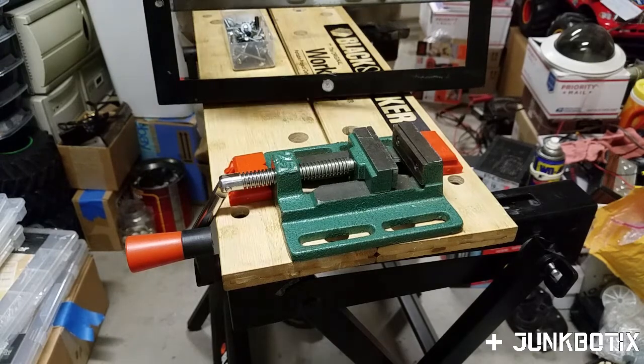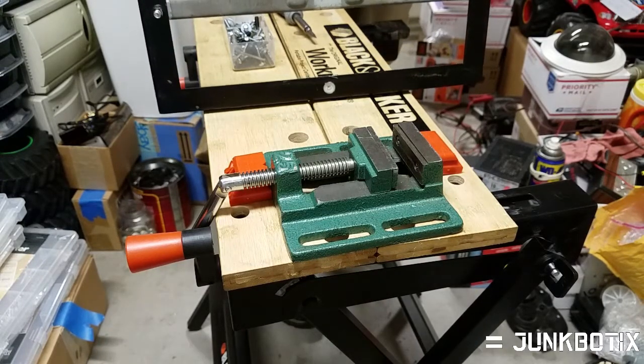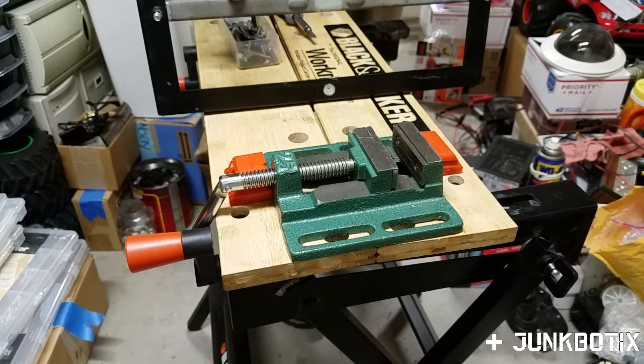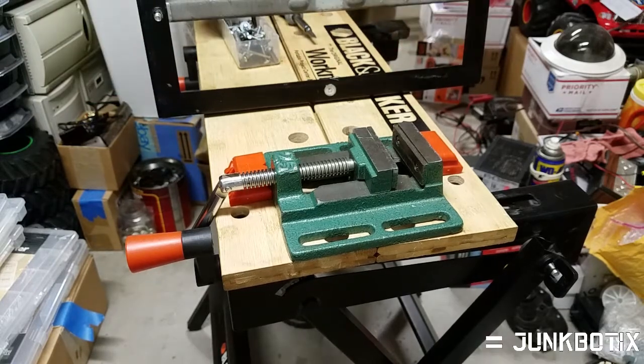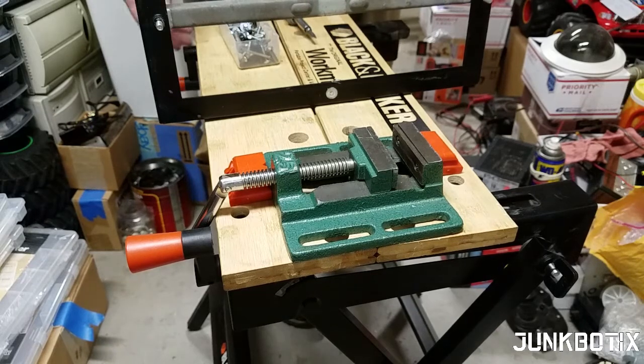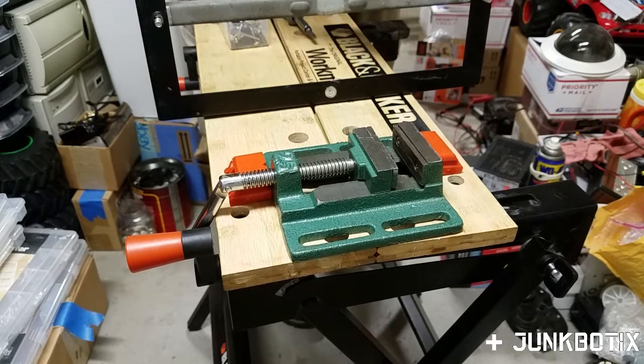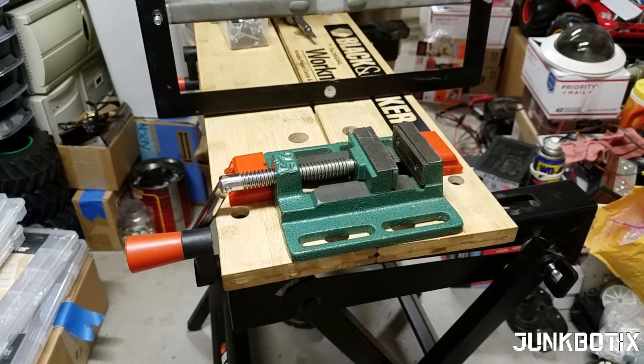That's basically it right there. What we're going to do is we're actually going to have to drill some holes into this in order to mount the motors. We're going to use a couple of L-brackets through some holes on the motor and then mount it up. We've also got to build some bearing blocks that'll go on each side — to support the end of the shaft of the motor. And the other thing we also need to do before that is cut the sheet metal to fit across this. I'm going to use this bar as a straight edge in order to cut that sheet metal, and for that I'm probably going to use a jigsaw.